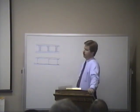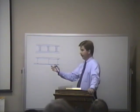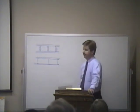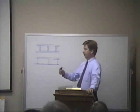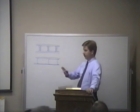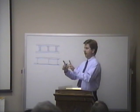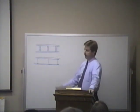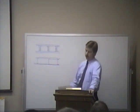If it's brick construction, you're hurting because you've only got so much gap. I mean, you can go on the outside and put the rigid insulation and then put the stucco, or you can go on the inside. But all three of those are very costly. You can go on the inside and put metal studs and then insulate and drywall, and provide your insulation and take up about this much of your interior space on the perimeter. And we've done that for basements and existing old buildings, throughout commercial structures. But you're getting into some pretty costly items versus a low cost, no cost.